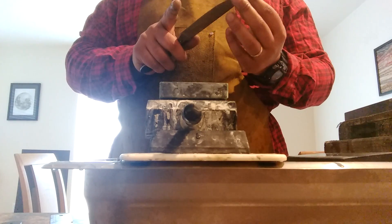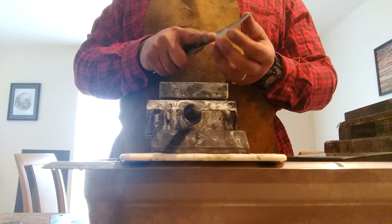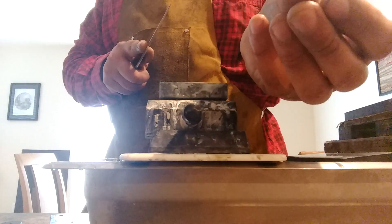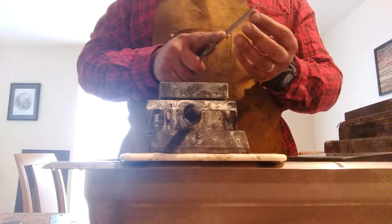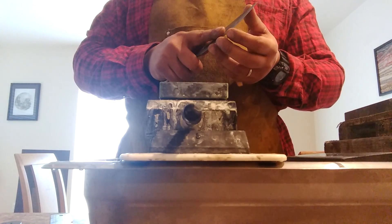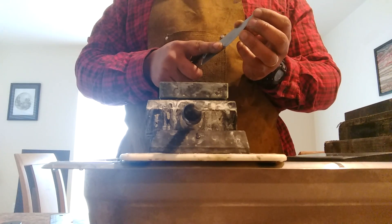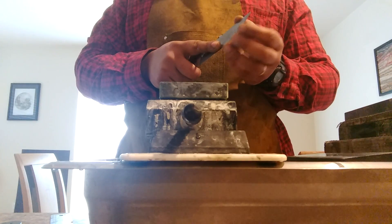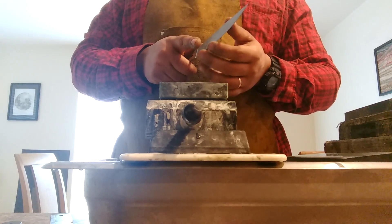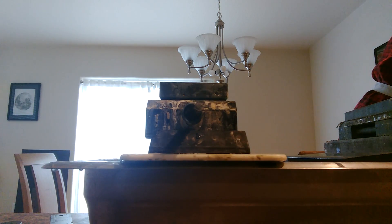We can feel that here — it cuts right on my finger. You're not trying to cut through your fingers with that three-finger edge test. You're just trying to see if it cuts you right away, just bites onto that skin. You've got more nerve endings on your fingertips. You have to put your thumb on the back and just go light. You've got to get a feel for it over time. Right now this feels a little too convex and I've still got a little bit of burr towards the back. It's something that has to be built with experience — you've got to put effort into it. It's not something you can just read in a book.